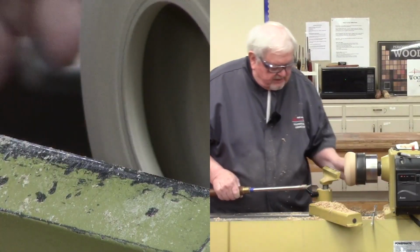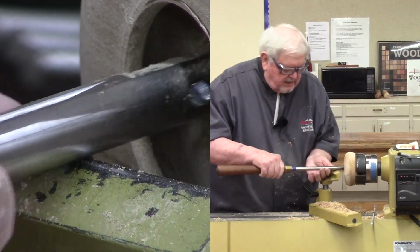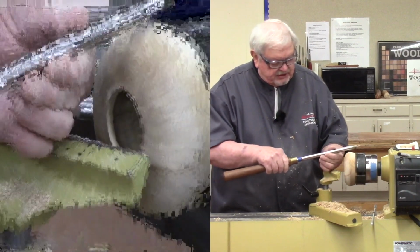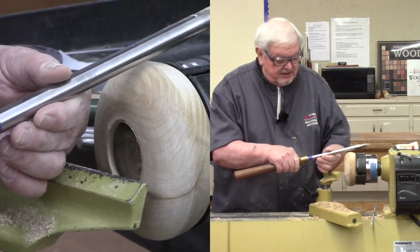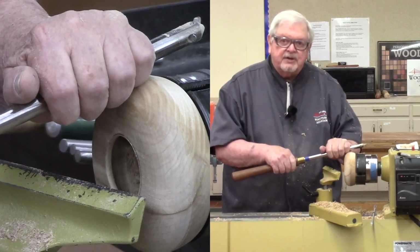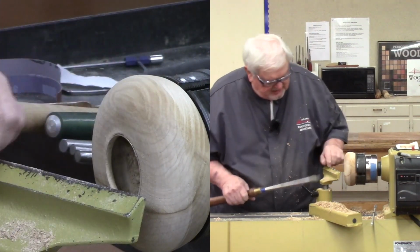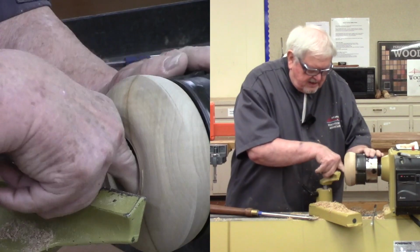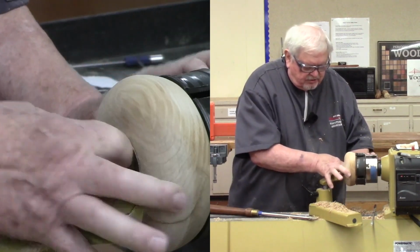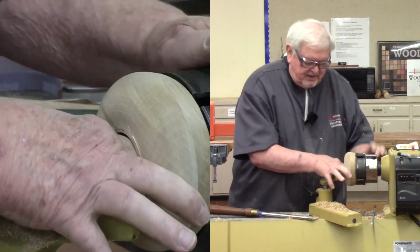Now you heard just a little bit of vibration there a second ago, and that was this tool vibrating. I'm this far over the tool rest, which means the farther this thing sticks over, the deeper the vessel is, the more the shaft needs to be stiffened. And the way it typically is done is by using larger diameter tools. I've got a nice little groove in here, and the point of the groove and notches gives me a place to feel. I know exactly where I am.